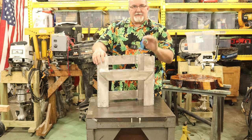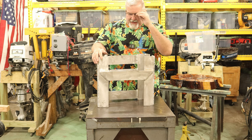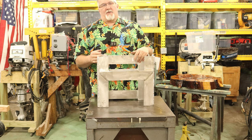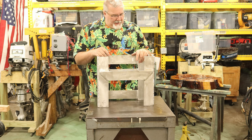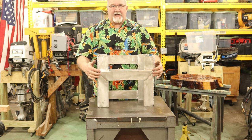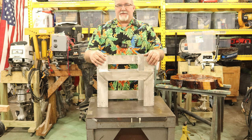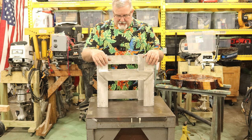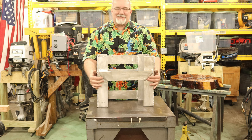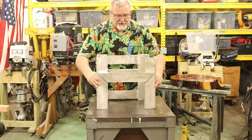Maybe I could utilize some of those bolt holes so I wouldn't have to put more bolt holes. And as I was holding things up in place, I'm thinking, none of these are gonna work. So I decided to opt to put a 3/8 plate across here like this. I angle cut it. I don't know why. I could have made it flat, but you can't see it once it's on the boat. It does dodge 2 bolts that are right here on the edge, which is the reason it's angle cut. But this will go onto the back of the boat, bam.